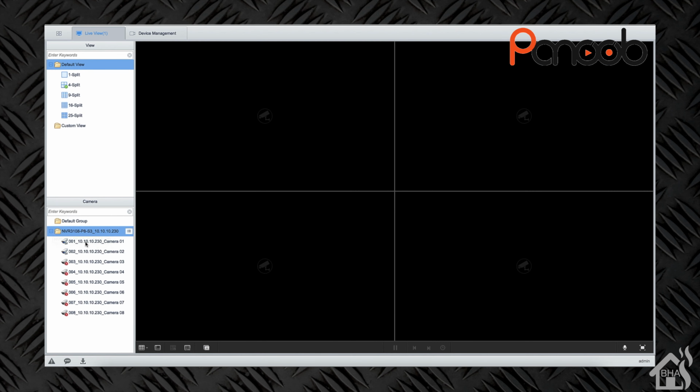All right, so let's see if we can get this thing set up in Home Assistant. So here we are, we're in the integration section of Home Assistant, and if we hit add integration down in the bottom corner, we should be able to search for ONVIF. That's what we're going to use to try to add this. So of course it'll do its regular search. I don't know that it will find anything, but that's okay. We can manually add it here.